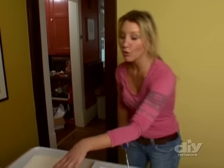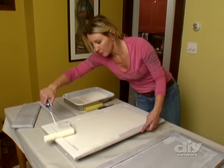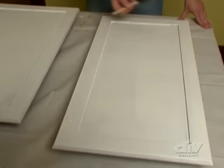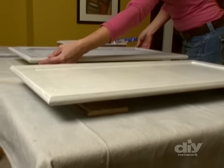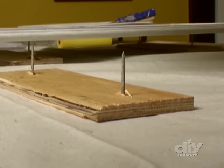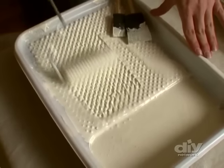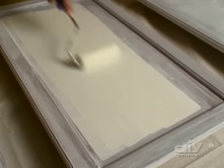Next, paint your doors, drawer fronts, and any trim. If these parts have raised or routed features, be sure to flow the paint into crevices and corners but don't allow it to accumulate there. A foam brush works well to get into any creases. Start with the back of the door and once that's dry, flip the door to paint the front — this way the front can dry face up with no possibility of smudging. We're using risers made from finish nails and scrap wood, which allows us to flip the doors when still wet or tacky, leaving nearly invisible marks. No matter what applicator you're using — brush, roller, or sprayer — always apply paint in thin, light coats but be sure to cover all areas.